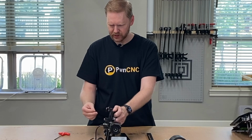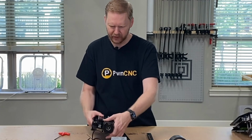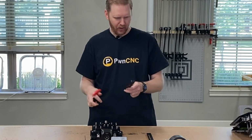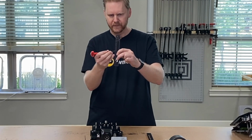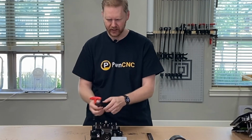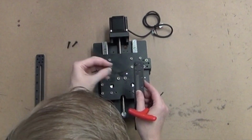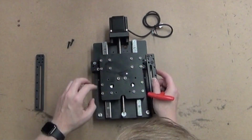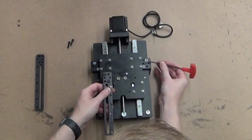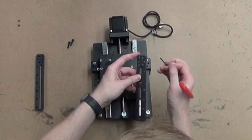So there, our limit switch, or our proximity switch here, is nicely set, all set on the back. Let's flip it over. And of course, you're going to walk around the other side of the machine. And we're going to take our track brackets. Now, all track brackets mount with these circular holes on the outside of the carriage. All the machines should go top left and then bottom right holes, and that's going to put right in here. You'll notice that this particular set has got a couple of extra nuts in there. They are reversed, so don't use those.